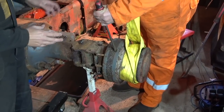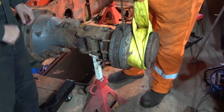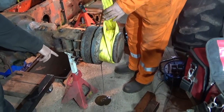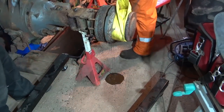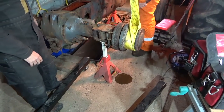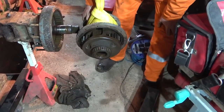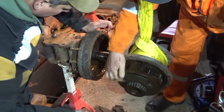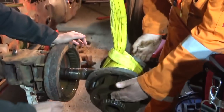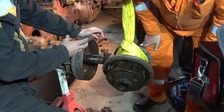So this section here — they've very kindly put a little slot in there for you to get the tool in. There we go, just take the weight off that. This is the final reduction gear set — they used these right up to the 300 series. So the half shaft drives these, these turn against that, and in turn this is fitted onto the short stub shaft here — that drives the wheel. So you've basically got a reduction set; it multiplies the torque. You can see there's a bearing here, and it actually feels fairly good.